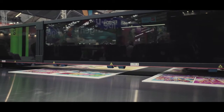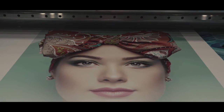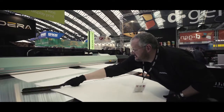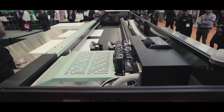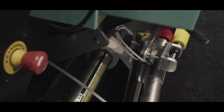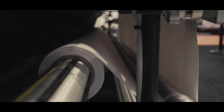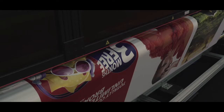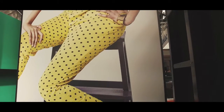The UV-Star Hybrid 320 has many outstanding features, but today I would like to concentrate on a couple which I think make it stand out from the crowd. Firstly, media transportation. Unlike other hybrid printers in this class that use only two rollers to maintain belt tension, the Hybrid 320 uses a unique patented three-roller design. This ensures that the printer belt tension remains stable throughout its operation and does not deliver any material skew during printing, so we can print extremely large long boards without any issue.